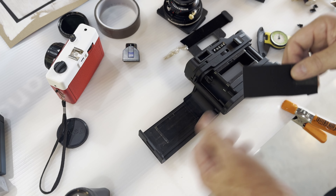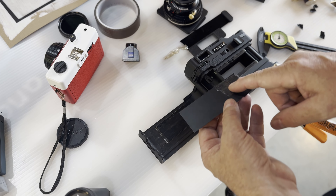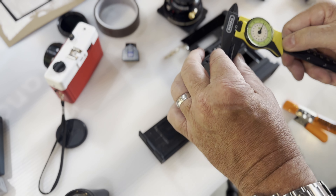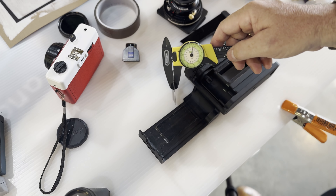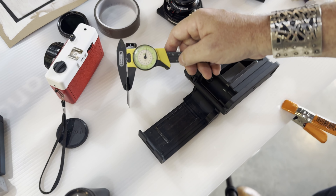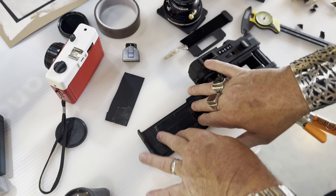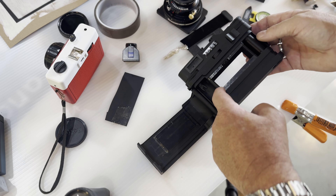What I found was that three layers of translucent Teflon tape plus the thickness of the black plastic equals exactly one millimeter, and that was perfect. That one millimeter was exactly what I needed for the focus to be spot on. So this side gets built up one millimeter.